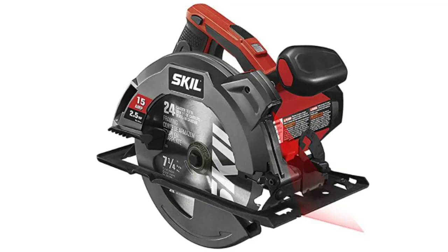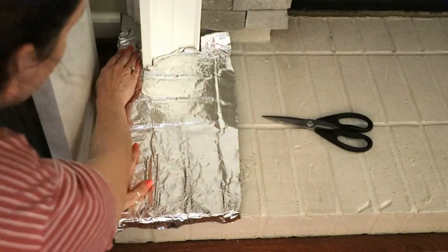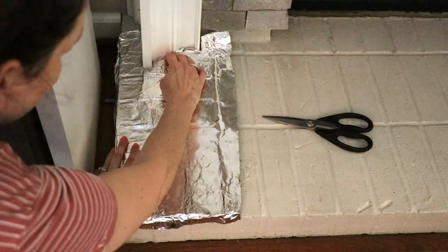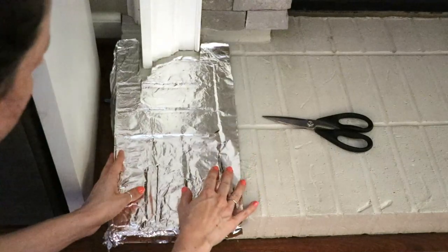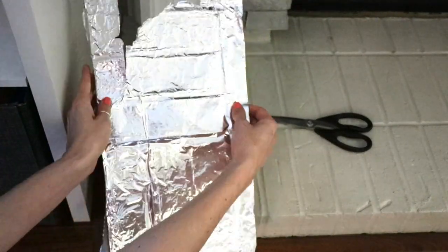You'll need some power tools to actually cut the wood. I'm using a few different saws because it's what we have. So first I laid out a template. You can do this with tin foil — this helps you mold to the shape and contours, and you can cut and press down where you need to, just to get an idea of what the contours look like. You can just trace this onto your board using several pieces of foil to get a nice outline.